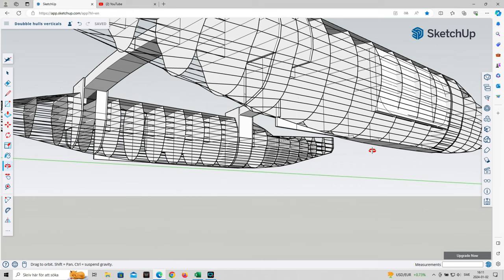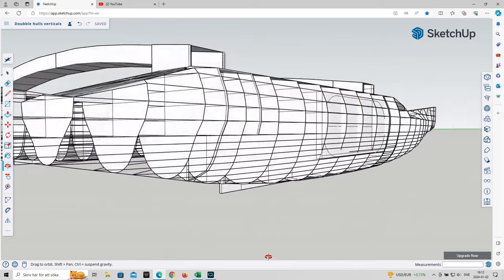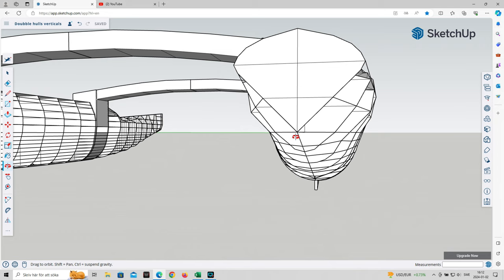But I'm planning on fitting centerboards, pivoting centerboards. So this centerboard here will flip down in use and be lifted up when not in use, and also be able to kick up if I hit something. The ending is thin at the water surface, so very thin in the ending here to get little drag resistance, and that's important in low speed.